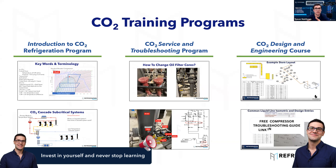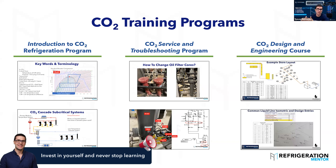I see CO2 condensing units starting to grow — more and more manufacturers are making them. They cost a lot more right now, but as time goes by and more manufacturers build this equipment, the price will come down. As regulations push harder, you'll see more natural refrigerant, low GWP solutions. You have to invest the time to get better at what you do so you can finish jobs quickly and design systems more efficiently and effectively.